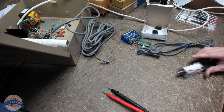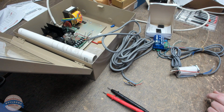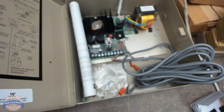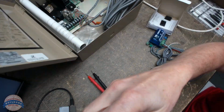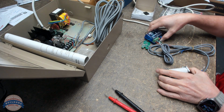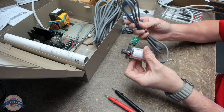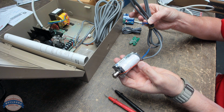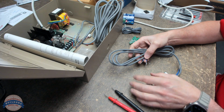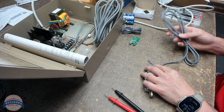Okay, so what we've come up with here, we've got a power supply, just my bench Locknetics 510. I've got it wired, it's all good. I've got wires coming out of it. 24 volts is how I have that set. In terms of a load, I happen to have a solenoid sitting on my desk for an Adams Rite exit device. So there's six wires coming out of here. I don't know what all these wires do off the top of my head, but all I'm interested in right now is finding out what the power is. I got two black, two blue, and then two more blue.